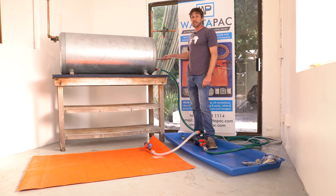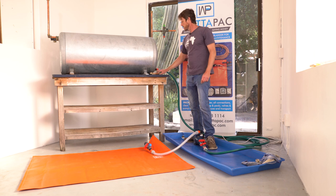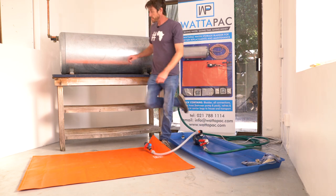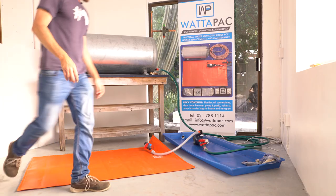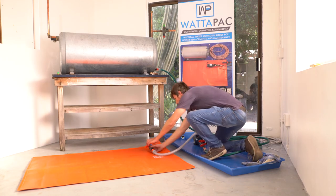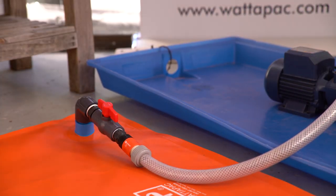Once you've done that, you're going to take the hot water vacuum breaker off and the siphonic process will happen naturally through the pump into the bladder. Once the copper pipe is inserted into the drain cock, simply remove the hot water vacuum breaker and siphonic action will immediately take place — water will drain into the bladder in about seven minutes through the pump. The water should naturally start flowing through the system.